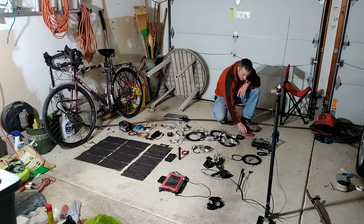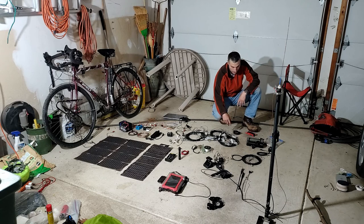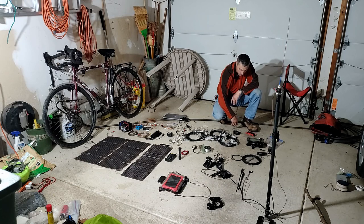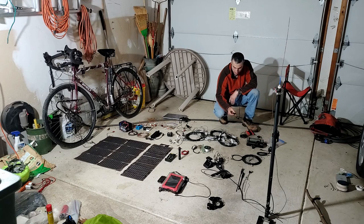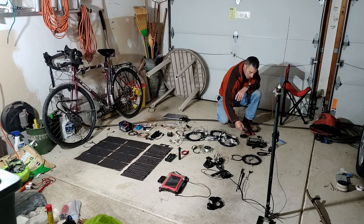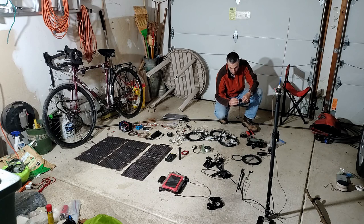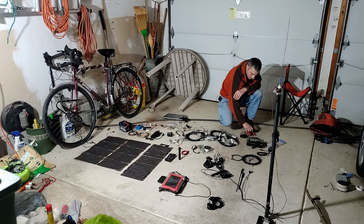And then I've got a bit of wire here also. Another thing about the KX3 is it has a built-in tuner. It's a real wide range matching tuner also. It's not your typical 3-to-1 matching range that you see in a lot of their radios, but they actually have a wide range matching internal tuner that you can get for that radio. So I've got some wire here that I can set up a random wire antenna with, and then a counterpoise. I've got two different options for how I connect that to the radio: just a simple positive negative BNC binding post, or a 1-to-1 balun that I made in this box. So just with wing nuts, positive and the ground side, again, that's a 1-to-1 balun. So just depending on what I want to do.